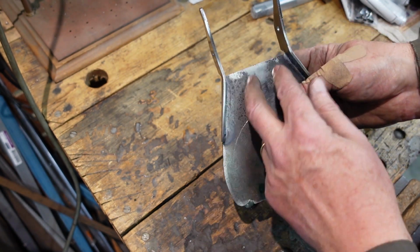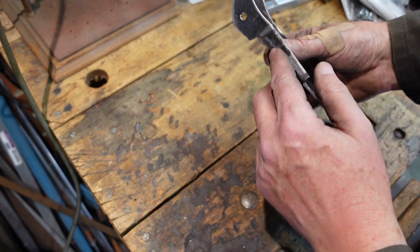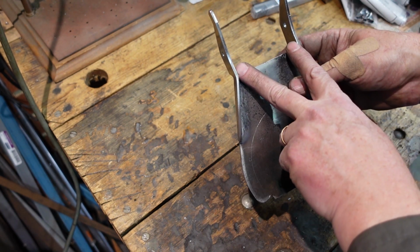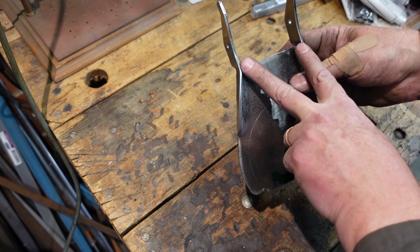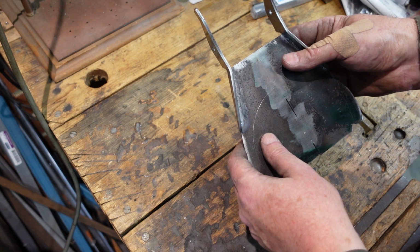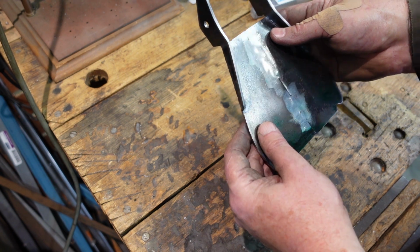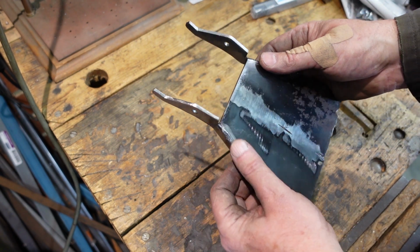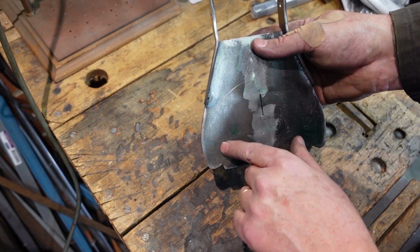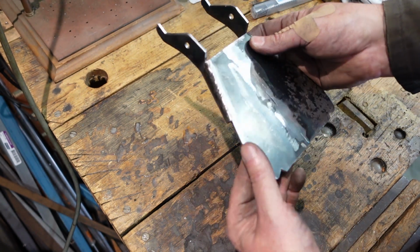I can't use this one because although these flanges are parallel, I welded up the corners and then went to the vise, just clamped it, squared it all up and tweaked it over. They're 72 inside rather than 75, so that's just a mistake on my part, I think, with the tuning and the widths of things. But apart from that, certainly the theory is there that yes, you could fold one of these up from plate, cut that out and pop that onto a face plate to clean that up, or a mill if you've got one. Makes it rather easy.